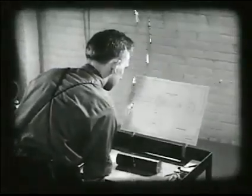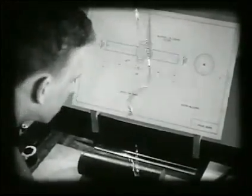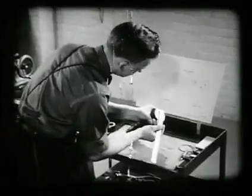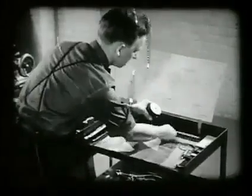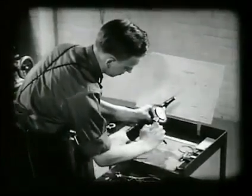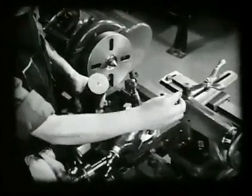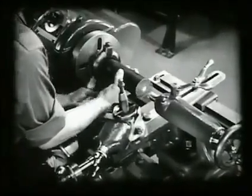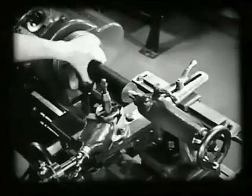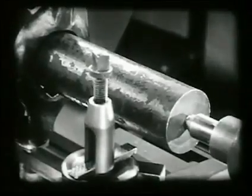Collar buttoned, sleeves out of the way, hair not dangling. The drawing, or the blueprint, constantly guides the good operator in his work from the rough stock to the finished gear blank. He studies the drawing carefully and figures out the order in which he will make the necessary cuts. Before doing the actual work, the overall dimensions of the rough stock should be checked. Selection of the right-sized dog is important — it should just fit the work, not too small. The tail should point to the headstock, the center holes are clean, and the tail center is lubricated. The rough stock is now placed between centers, and the tail stock spindle wheel is turned until the piece turns freely, not binding and not loose. Because the stock is rough and uneven, a first truing-up cut must be made before accurate measurements can be taken.